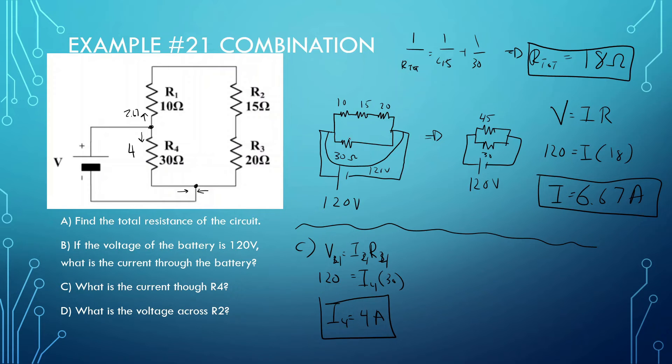There's more resistance over here than over there. So if 2.67 amps is going through all of these, now if we're trying to find the voltage across R2, we know the current is 2.67 amps. V2 equals I2 times R2: 2.67 times 15 equals 40.05 volts. And we should know that from here to here is 120 volts total, so each of these adds up to 120 — so if this one is 40, the other two are going to equal a combination of 80.